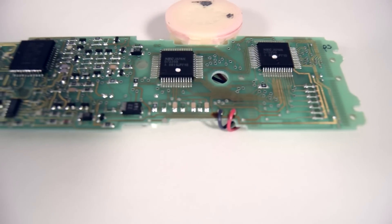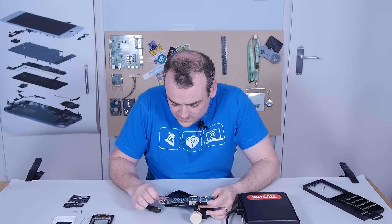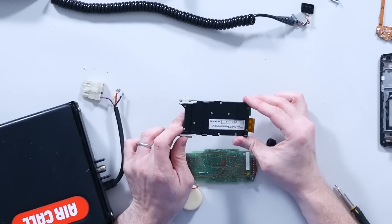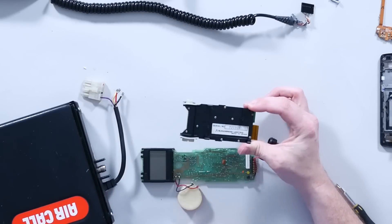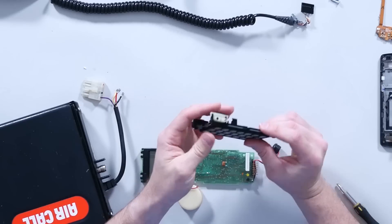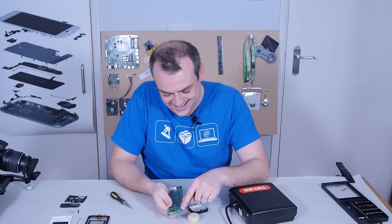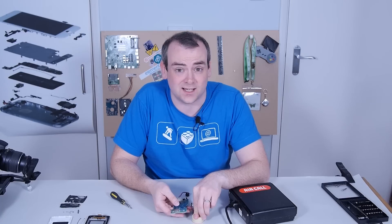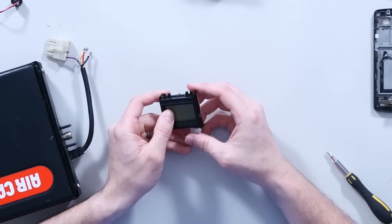There's not a huge amount to see on here — we've got a few integrated circuits on one side of the board, a load of passives, and it's a really nicely laid out board. It really gives a good demonstration of a single-layer PCB. A lot of the branding is to do with a local installer, not the actual manufacturer, but this gives me my first concrete evidence of who the manufacturer might be. The brightness, contrast, and volume buttons on the side are actually part of this display sub-module. The backlight for the LCD uses two little incandescent lamps soldered straight onto the board — I imagine they got really hot and probably went some way to destroying the screen.